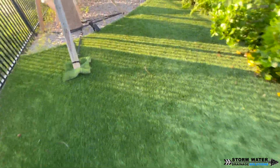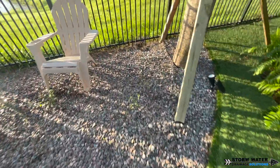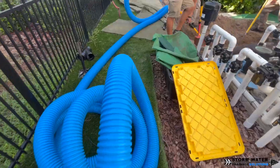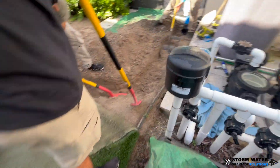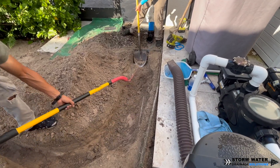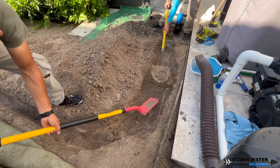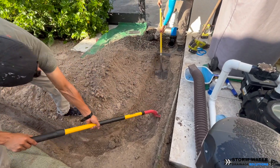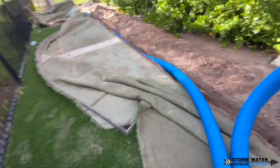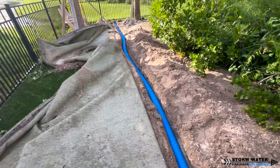In this particular job, we have AstroTurf through the entire backyard. That downspout is putting off a tremendous amount of water due to it being a super gutter that runs along the pool enclosure. Those super gutters put off a lot of water. And if you're having a flooding issue on the side of your home where that super gutter dumps, a simple solution could be a downspout drain for that downspout coming off of that super gutter.